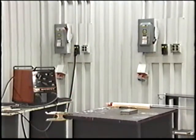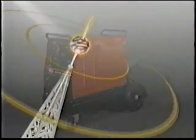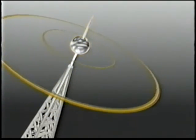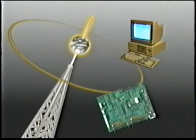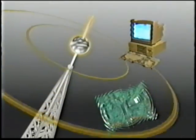To begin setting up your welder, place it on a clean level surface or the optional undercarriage. Be sure nothing blocks air circulation around the welder. The high frequency generator in the machine, being similar to a radio transmitter, can cause radio, television, and electronic equipment interference and much more — it can damage or destroy sensitive circuitry such as computer systems. So proper earth grounding, as specified in the manual, is extremely important.